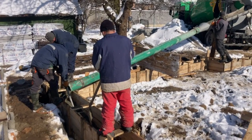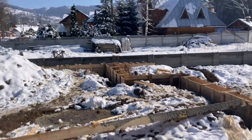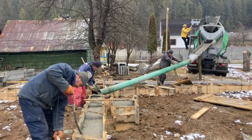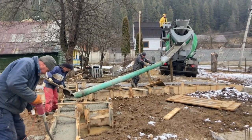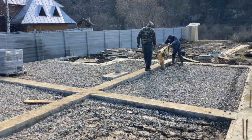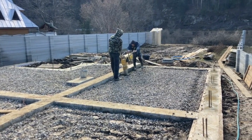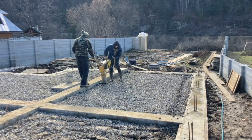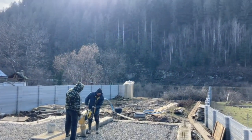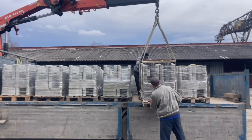Here's the pouring of the foundation for the home — it's basically identical to cinder block construction, sometimes a little beefier. In an area with a frost region, you typically always want to make sure it's below the frost line. After a bite to eat, the concrete's cured and they're preparing the ground, tamping the gravel. Notice the rebar sticking up from the bottom — this is where the columns will tie into the slab, giving you vertical structural integrity.